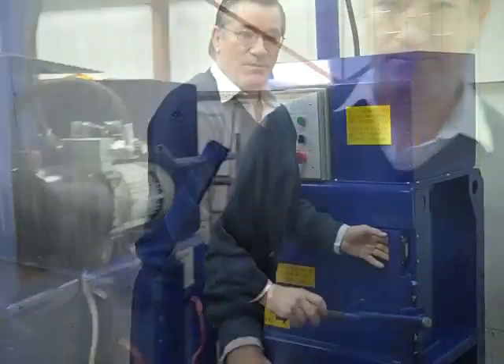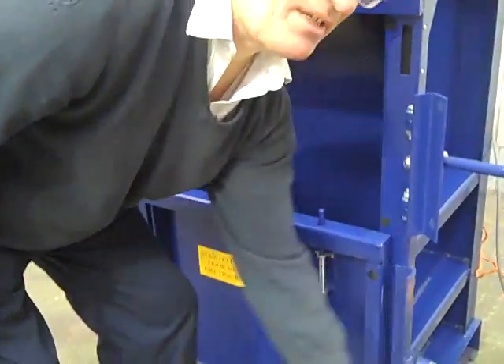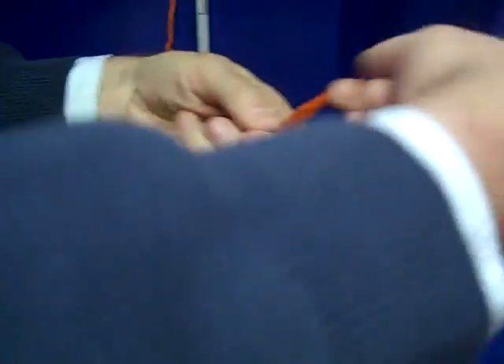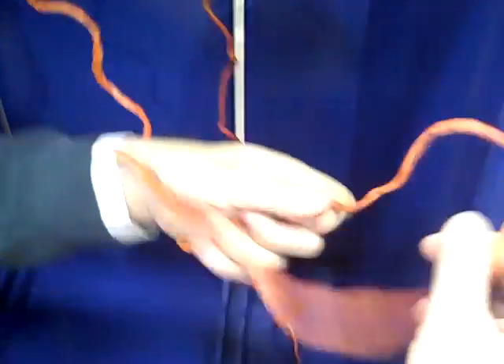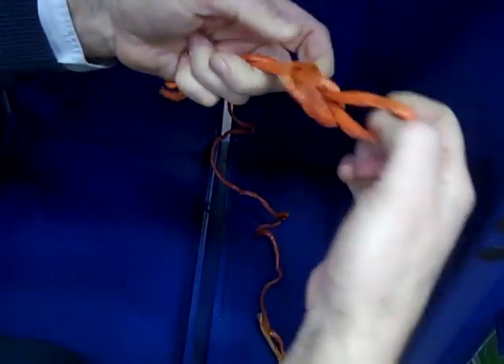It's all set up now and it's ready to go. So we'll go to the front of the baler. Every time you're going to use the baler, every time you're going to set it up, this is how you would do it. You're going to pull the string from inside the baler — you'll see the string is coming through like this. You need to have enough string to go inside this groove. First of all, it's very important to tie a very simple knot on this string. I'm just going to tie what I call a granny knot — it's just a little loop that won't slip. You just make a nice little loop and tie a little overhand knot.